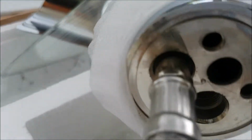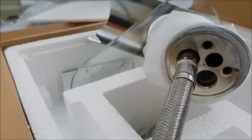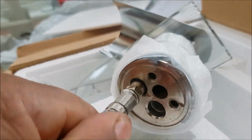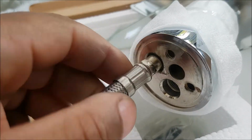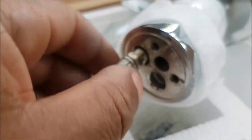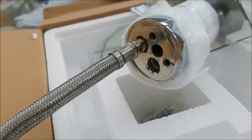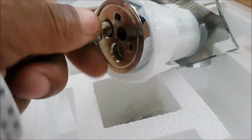And you can see it's got a washer. Let me come out a bit too close. There's the washers, yeah? So one goes in, well, it's a double seal. However it works, it stops the water coming back on you. So you just tighten that in, yeah? On the end here, you can see the shape, it's a nut. So you need to get a spanner, pliers, whatever on there, and make sure that is locked in so you're not going to get a leak. Anyway, that's how you do that part. Let's take it back out again.